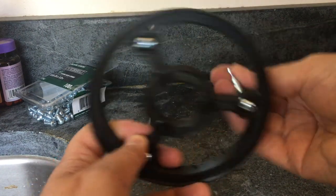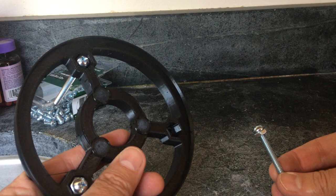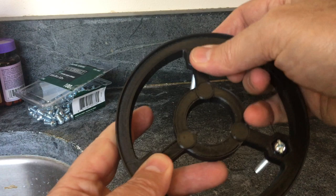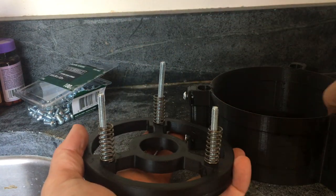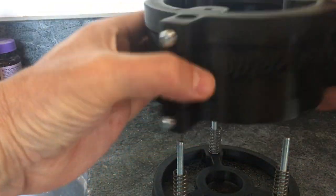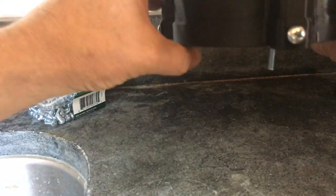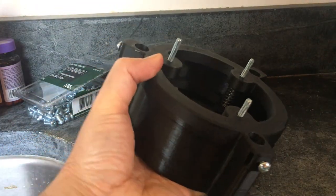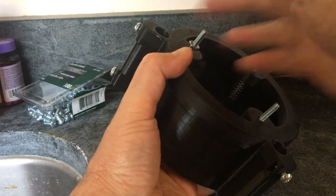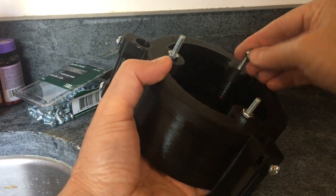Here's the lower mirror cell. I couldn't find any hex heads at the hardware store — I went to a couple — so I've jammed on a nut as tight as I can get and I'll just use these. You put three of them in like that and then put your springs on and thread them through. I don't have the knurled nuts printed so for the time being I'm just going to use regular nuts and then I can upgrade that a little bit later.